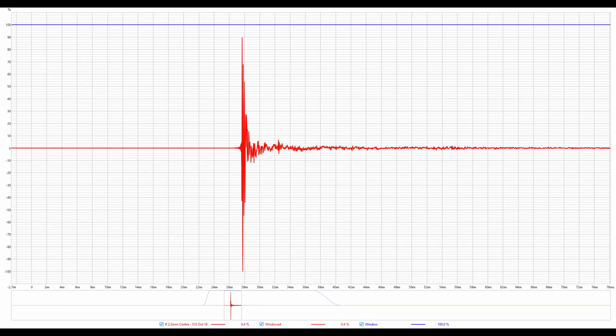To measure the latency of the wireless technology I used the 2.5mm center channel output port on the dongle as a loopback device, measuring the time difference between the signal coming out of that port and then coming out of the wireless speaker. It consistently measured as 27.5 milliseconds. The overall audio sync has been a complete non-issue — I cannot tell the difference. The only time there is any delay whatsoever is when it's changing audio formats.